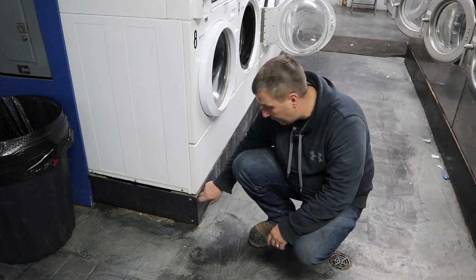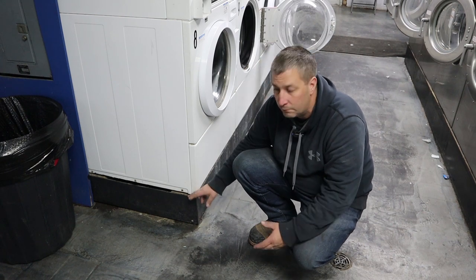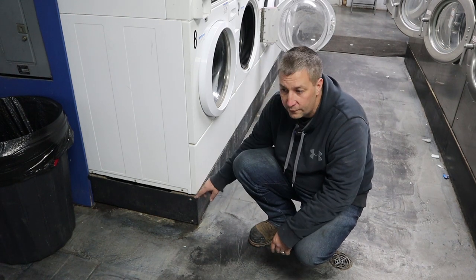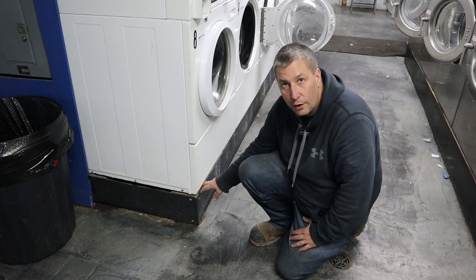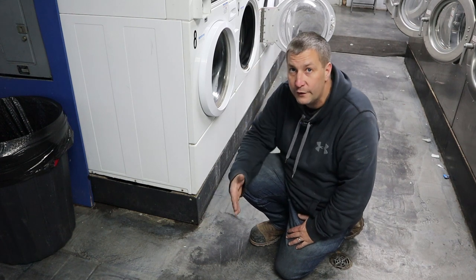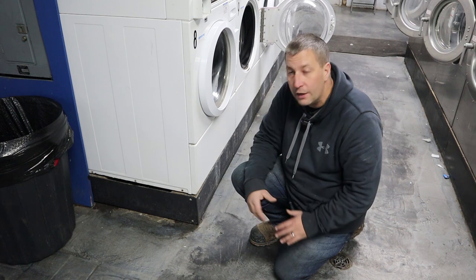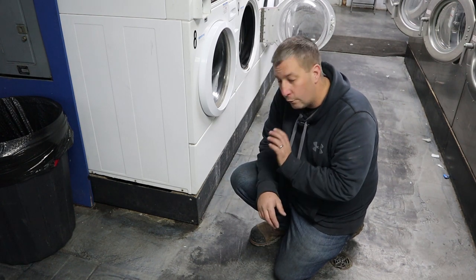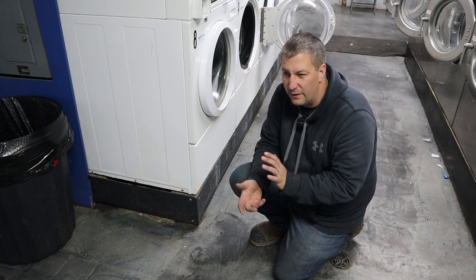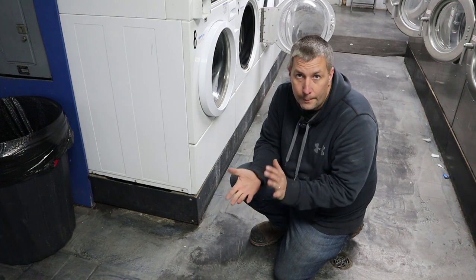But I had the question the other day from a viewer. He said, what is that black stuff that's wrapped around the base of your 2x6 construction? This is a poly plastic sheet that I get at Menards. It's 1/4 inch thick. It has a smooth side and a rough side. Now I face the rough side out because the smooth side, I seem to scratch it all the time and then it looks like garbage. And the rough side's a little duller, more of a satin finish, and the smooth side's more of a gloss finish. So you can flip it either way.